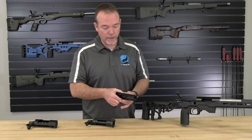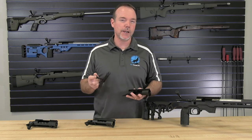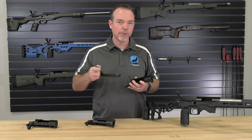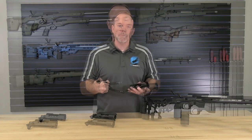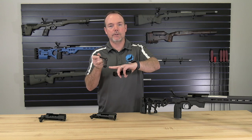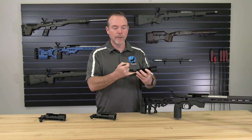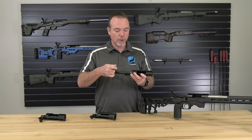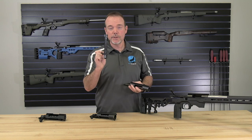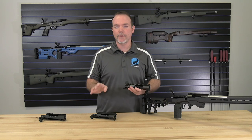What makes the action shoot so well is that they're built to all of BAT Machine's benchrest tolerances. You'd think that would make an action bind — some people say you don't want a BAT Machine action because the super tight tolerances will make the bolt sticky. But the truth of the matter is it's actually the opposite. BAT Machine does not have an anti-bind rail or cut built into the actual bolt. On a Remington 700 there's a lip that runs along the side of the receiver so the bolt rides on that second lip — a bind rail. BAT doesn't have one simply because it doesn't need it. With this action you've got two and a half thousandths clearance for the bolt bore raceway — that's one and a quarter thousandths per side. In comparison, a human hair is three thousandths, so you've got about one-third the width of a human hair clearance around the bolt body raceway.